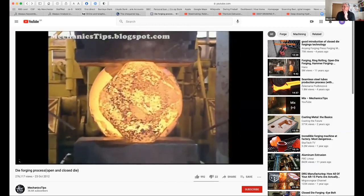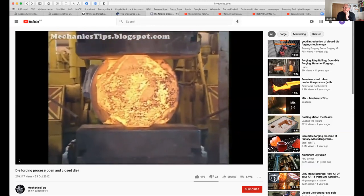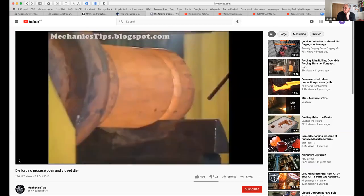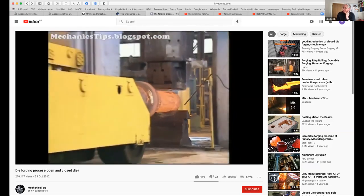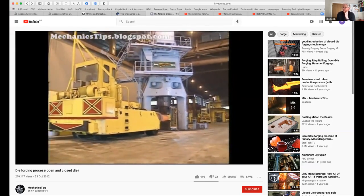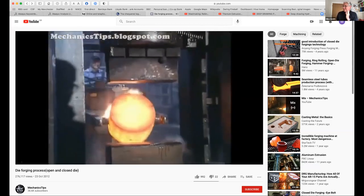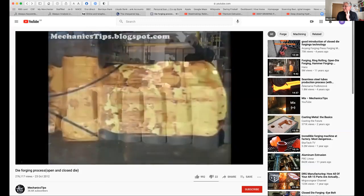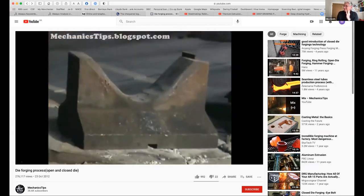Lengthening and upsetting are typically done using multiple impacts as the workpiece is incrementally advanced lengthwise and rotated about its longitudinal axis. There is essentially no limit to the size of forgings that can be made using open die forging. They can range from a few centimeters to 30 meters in length and weigh from a few to up to several hundred thousand kilograms. Although fairly complex shapes can be made using open die forging, most are rather simple solids or hollows requiring considerable machining to achieve final shape. Forgings are produced using simple flat, V-shaped, or semi-round dies.